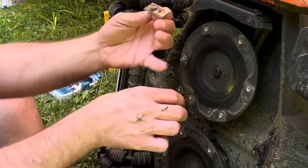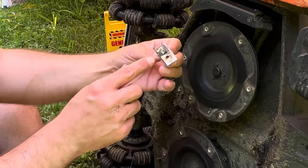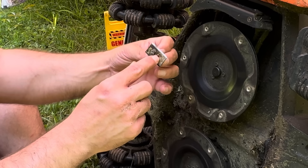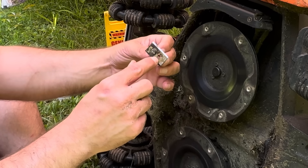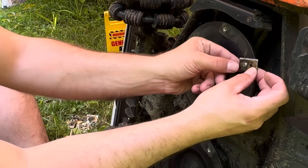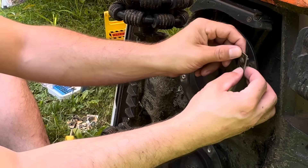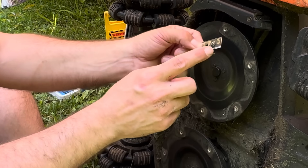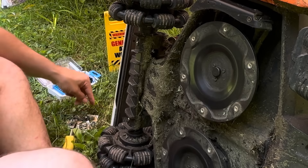I got them all off. I'm not going to get rid of them because it looks like only one side is bad. If I move the screw to the other hole, it will use the other side of the blade — so if it's flipped around, it's now cutting on that side. But I'm going to replace them right now to show you how to do that.